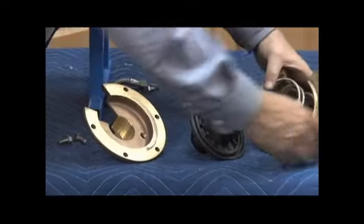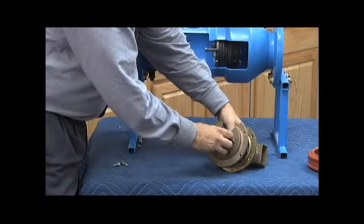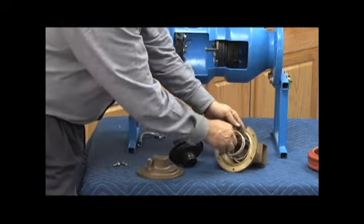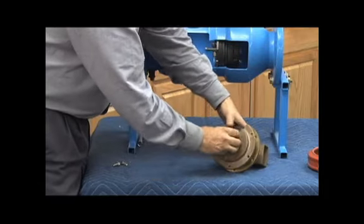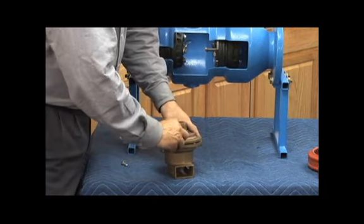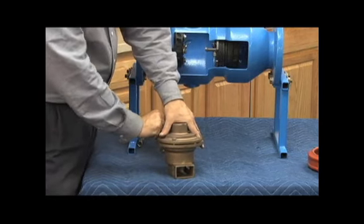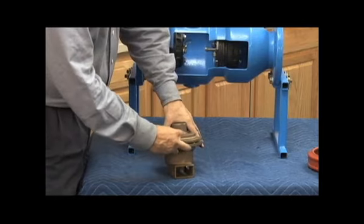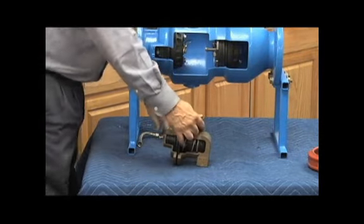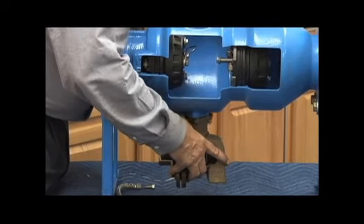Reassembly, relief valve spring first, our relief valve diaphragm. We do not have to line up a relief valve sensing line. We saw that that was an external hose. Low pressure sensing line comes through the body, through the inside here. So reassembly is going to be like this. Get our bolts in place. Relief valve mounts by an O-ring, so if we took it off, we're going to go ahead and replace that O-ring, reattach our relief valve body to our check body, like this.